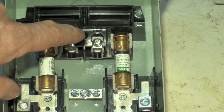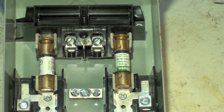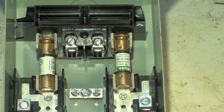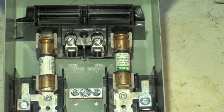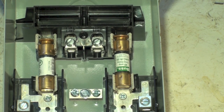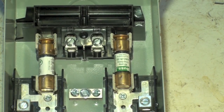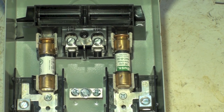Be careful when you're doing this. Be sure you've got your leads held properly, your meter is set up properly, and you're not touching anything else besides those two terminals. Don't put your fingers in there. If you want to find out if the power is off, that's the way to do it. Don't try to connect to the top of the fuses or anything like that, because when the disconnect is pulled, the fuses are not connected in the circuit.